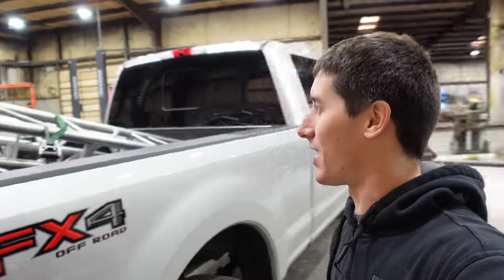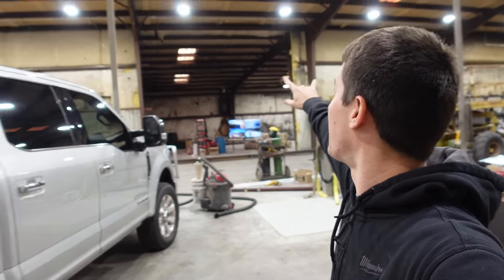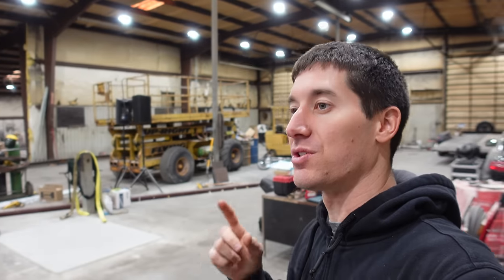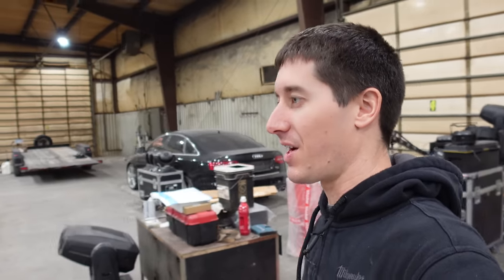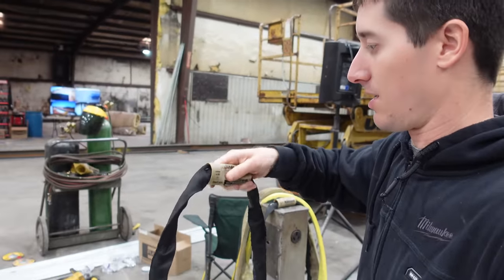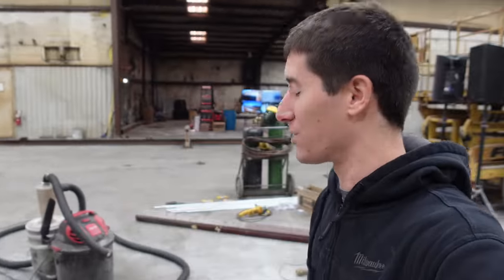Today we now have 30 feet of 12 by 12 light-duty truss which should handle a 3,000-pound load. We're going to put about a 1,000-pound load right up there between those two beams. My brother knocked out some brackets on the plasma cutter last night. We're going to use those brackets to shackle the rigging tool that's going to hold the truss — way overkill for what we're putting in the ceiling. I've got aircraft cable, GAC steel flex lift, rated at about 5,000 pounds the way we're using it.